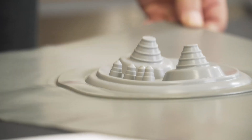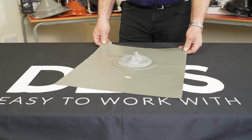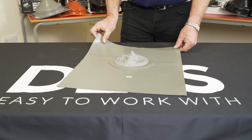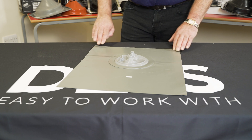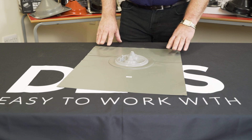The flashing itself is made from coated lead, which has an acrylic coating enamel applied to it. This will prevent any leaching that you would get with a standard lead flashing onto your tiles. The fact that it's coated lead means that it dresses like a dream — it is bendable, foldable, and stretchable so that you can flash it around your tile profiles with ease.